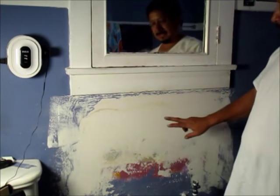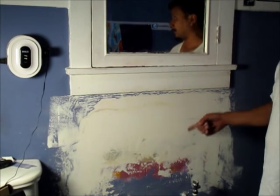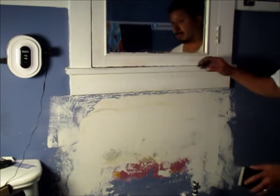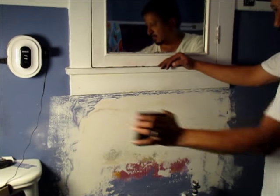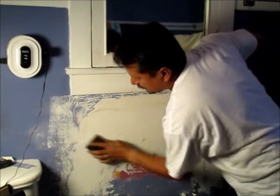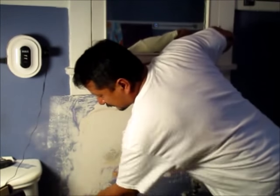When you've got fresh or dry joint compound or drywall, you're going to have to prime it because that stuff is going to drink paint — it will absorb a lot if you just put regular paint on it. These are the sanding pads I was telling you about — they're like a buck each. When you sand, try to go diagonally, not just straight up and down, because then you're going to have lines and grooves. Don't press too hard — let the sander do the work, or you'll put lines in it.